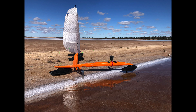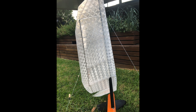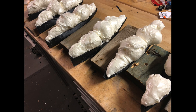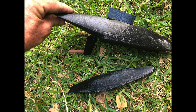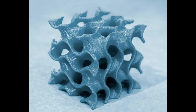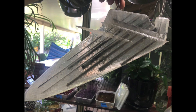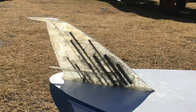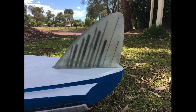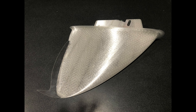The breakthrough came after I built my model of Sail Rocket 2. Despite the sail structure being printed in vase mode and only having a thickness of 0.4mm it was very strong. In addition the floats were similar but I had filled them with expanding foam, and the resultant structure was extremely strong, far exceeding my expectations. Instead of the complex method of how I made the Sail Rocket sail I just used a gyroid infill pattern for fins and then filled them with epoxy. The first fully 3D printed fin that used this process was the Fangulator fin, quickly followed by the dual Fangulator. Then Fangy started down the variable airfoil fin path and I started playing around with embedding other stuff like electronics and lights with the aim of eventually making adjustable fins.